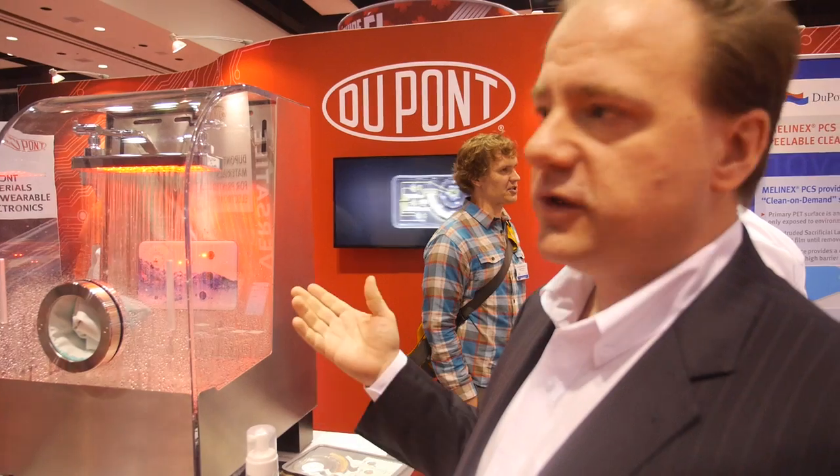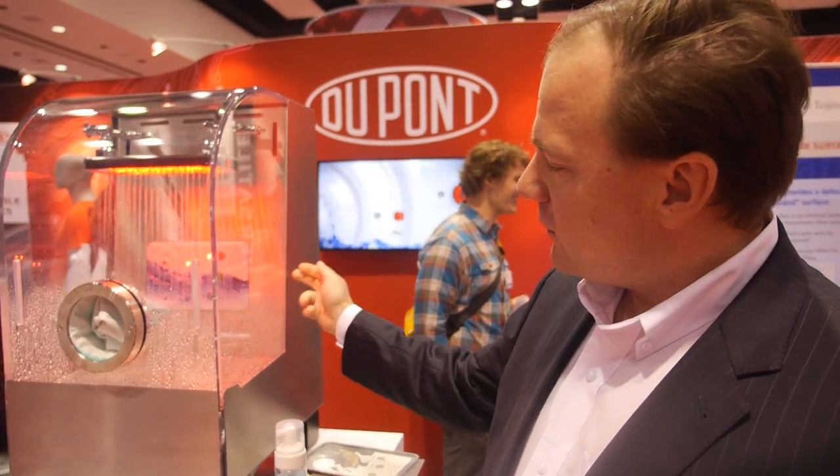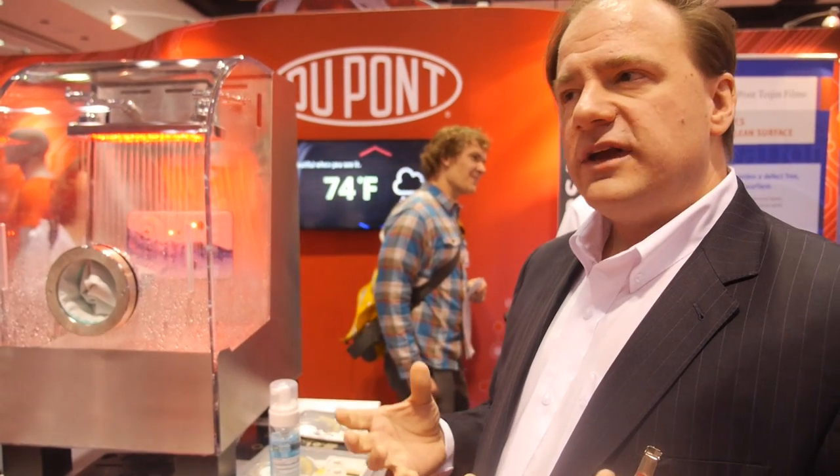This particular part is a demonstration to show how robust the technology is — that it can operate in one of the probably least friendly environments possible for capacitive touch. In a real world, I'd see a part like that going into an appliance, an automobile, or even consumer applications where you want to add functionality to plastic without adding complexity.